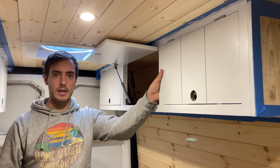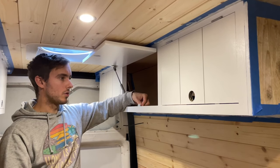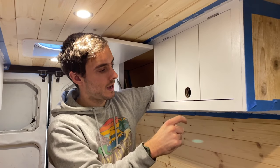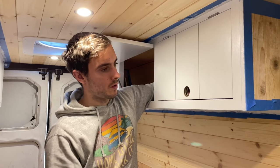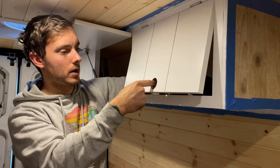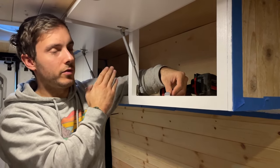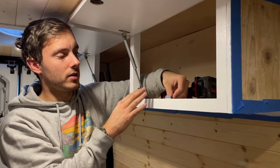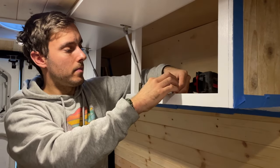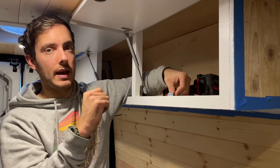I don't have the dividers in here yet, so I'm going to take my catch plate which is going to go on this part of the door and just reach around so that we're in the centre of this lock hole, and push the door forwards with that catch plate until we're flush on the bottom. Once we're flush I'm going to open that door and that's going to leave this in exactly the position we want it. If you've put your dividers on you might have to fiddle around a little bit, but that will stop our door from going back so it's not flush, and then we can get our lock in place.